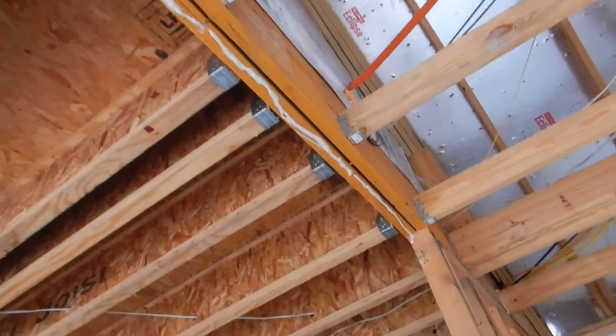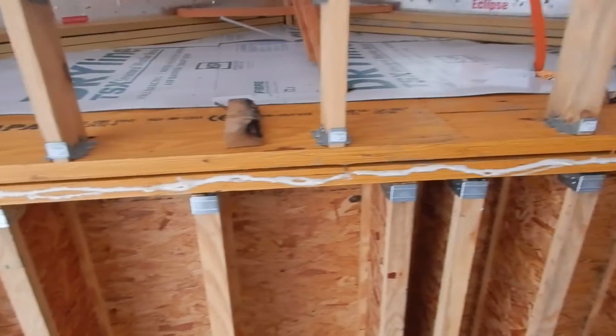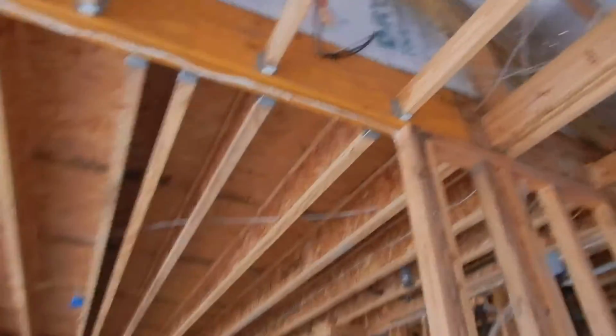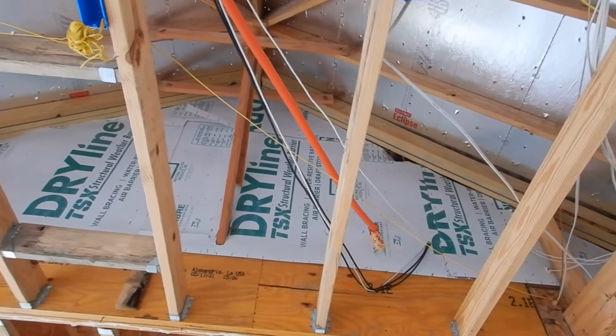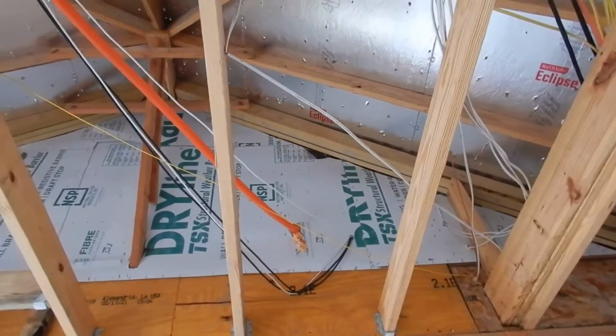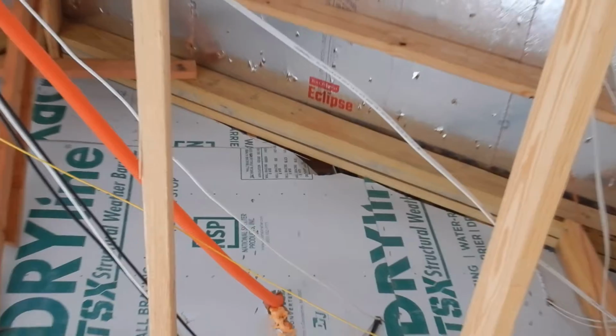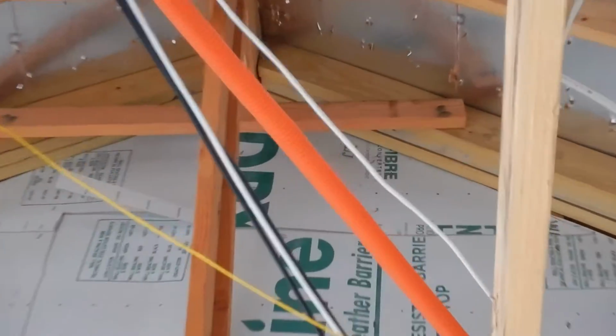It's not what I came in here to show you, but you see something twice, you see something else. Was that sealant supposed to go between those two headers? What's that about? But I came in to show you this board, this construction sheathing. And we come up here and it's fine. Everybody gets that, everybody wants it. But look, see those holes over there? That's not right. You say, oh, well, we have it everywhere else, but not there. And here's another thing that's going on. These are called collar beams right here. We don't have any upstairs. I didn't call it to your attention. But they're supposed to have 3 fasteners on each end, not 2.